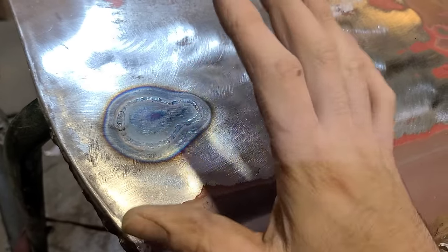The other thing we're going to be doing in addition to the chop is, these are '52, '53 doors, and we're going to be making them back into the earlier style doors, which just have the one piece glass instead of the vent window. So having this skin off, I've now got totally open access where I can put in my window channels and get that set up. Obviously there's no window channel at the front here, so I can build the bracketry for that.